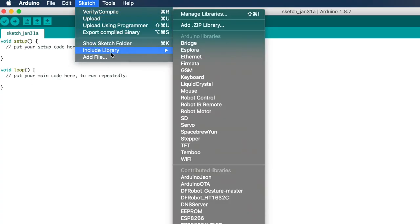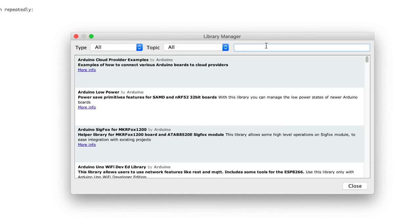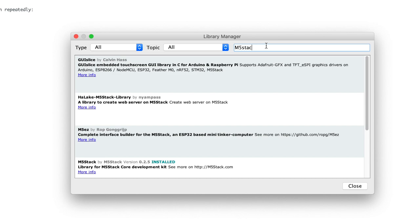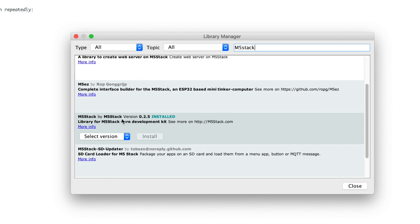So we'll open our Arduino IDE, and first of all, the basic requirement is that you must have the ESP32 boards installed in this system. If you don't know how to install the ESP32 boards, I will attach a link in the description. Watch that video and you will learn how to install the ESP32 boards. After installing the ESP32 boards, you need to go into Sketch, Include Library, and Manage Libraries. You need to download the M5Stack library in your Arduino IDE. So just search here for M5Stack, and you will be shown this particular result, M5Stack by M5Stack.